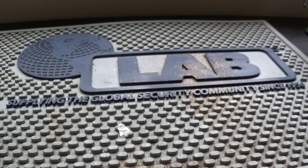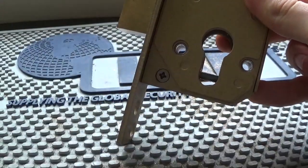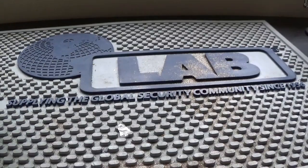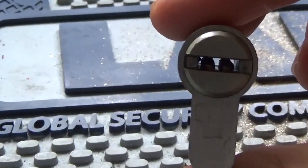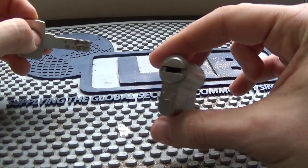Euro cylinders - I want to talk about Euro cylinders and locks on doors in a commercial setting, from my experience what I've seen that is kind of stupid and what's smart and practical. A Euro cylinder is called that because it has a profile that looks a certain shape - that's where it gets its name. They come in different classes and security standards; this one is a basic double row of pins and this is a higher security one.